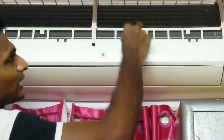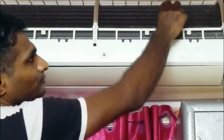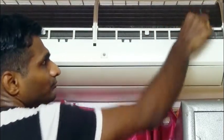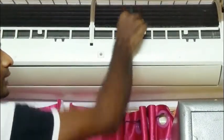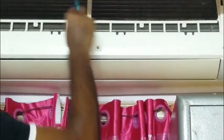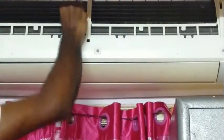Now, if you do this every 15 days, it would be very useful. The filter will be maintained and cleaned properly. We will clean along the fins. If the fins are cleaned and refreshed, it works much better. We will also work on the coils with brushes.